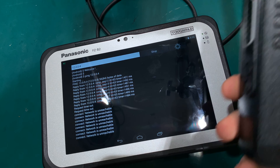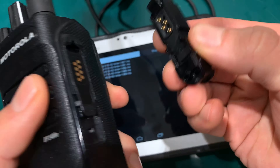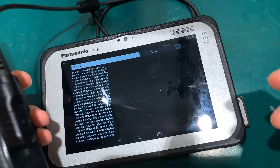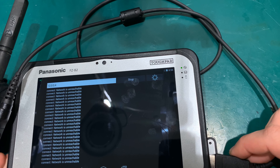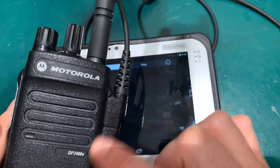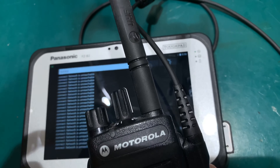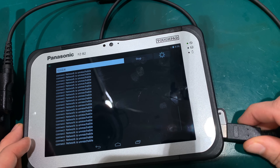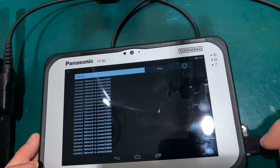We are going to try something different. Here is the DP2400E — the whole series is working great. They use a different cable, but as I told you, the cable is not that important; the magic is inside the radio. We are doing exactly the same — powering our radio on and plugging it in. The radio is acting as a router that routes packets from the USB to the air interface. Radios actually have three interfaces: the air interface, the Bluetooth interface, and the USB interface.